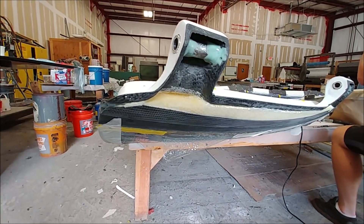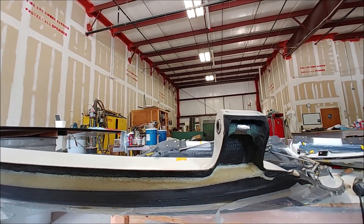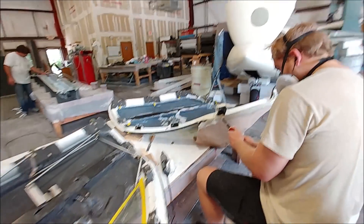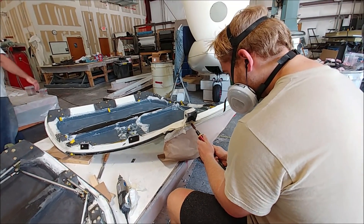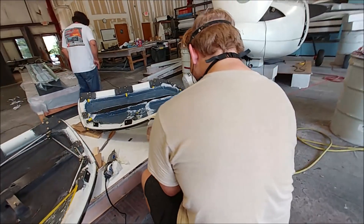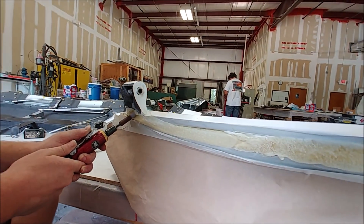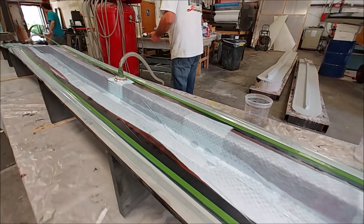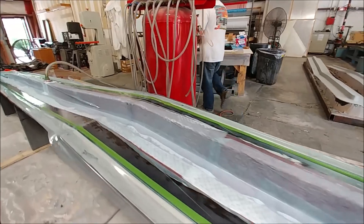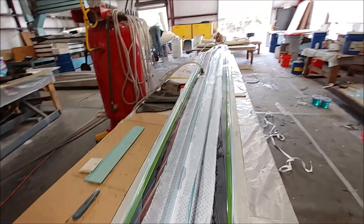Here's the foam that was laid in there. Keith's been spending some time fairing that back out to the flanges, and then we're going to be filling in those pockets with some heavier material and putting the upper skin on. You can see him working with a little air tool cleaning up that foam. That foam is actually pretty hard once it sets up — quite strong, you can't push your fingernail into it. And there's the foreplane spar now under the bag after the first round of layups and core. Tomorrow that'll get peeled back, the closeout plies put in, bagged again, and we'll have both foreplane spars done.